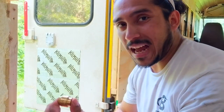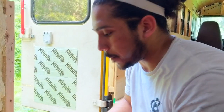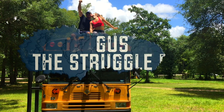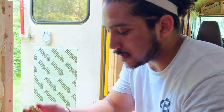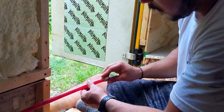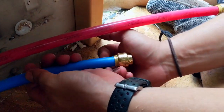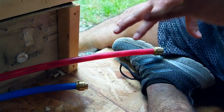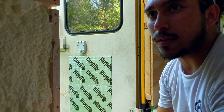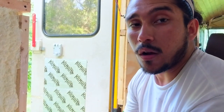First things first, in order for us to be able to pressure test our water system we need to put caps at the end of the system just so water doesn't run out and we'll know exactly what's going on. We got these SharkBite fittings — all we have to do is put them at the end of our connections where we don't have anything plugged in yet. This basically shuts off the system so whenever we run the system it'll run into the pipes but won't run out, and we'll be able to see exactly where it's leaking, if it is leaking anywhere. Hopefully it's not leaking anywhere.